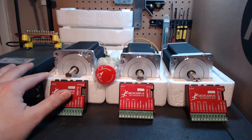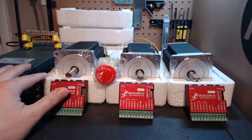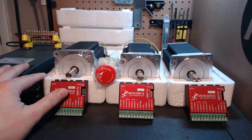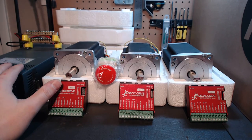As far as your motors go for muscle, we're looking at NEMA 34 format. They weigh about 11 pounds a piece, they're 1700 ounce-inch torque rating, 5 amp input, and they have a 7.5 millihenry inductance rating. The lower the inductance, the less resistance the motors have, which means they're going to be faster. So your rapids with these motors are going to be very, very quick, and very smooth when you're running that kind of power.